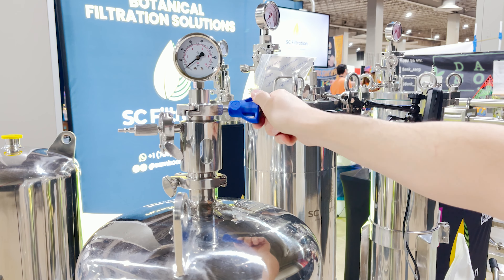Every system includes a three-way valve to recirculate your miscella to your centrifuge. An optional feature is a spectrometer, which provides a graphical representation to help you determine the extraction endpoint — showing you the concentration of cannabinoids, fats, pigments, and similar compounds. This gives you a visual representation of when you should stop reusing that solvent, helping you increase efficiency by knowing when it's safe to reuse solvent and when it's necessary to stop.